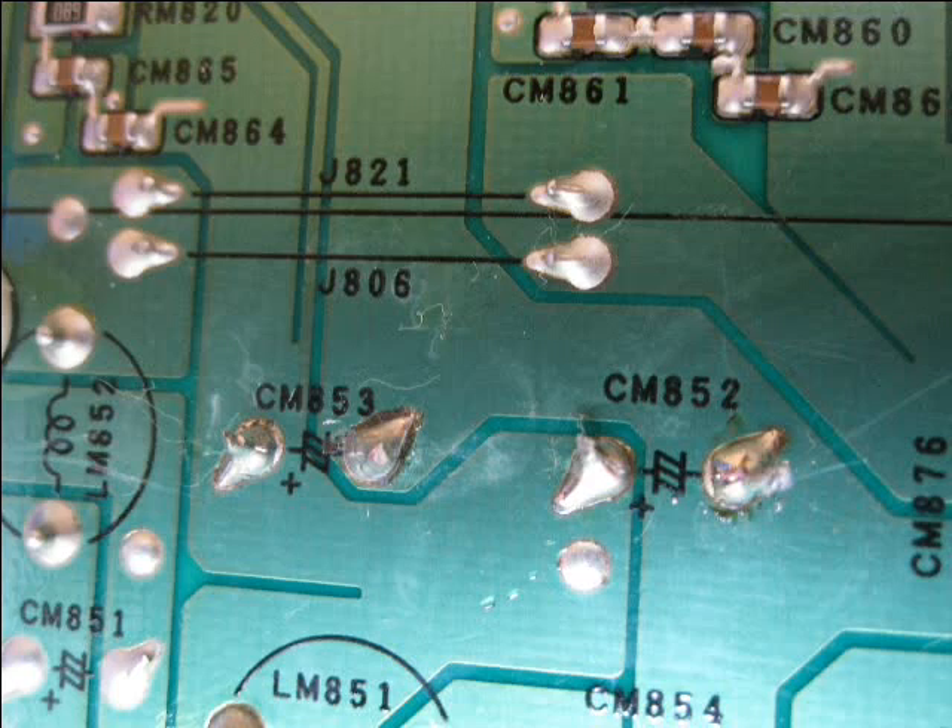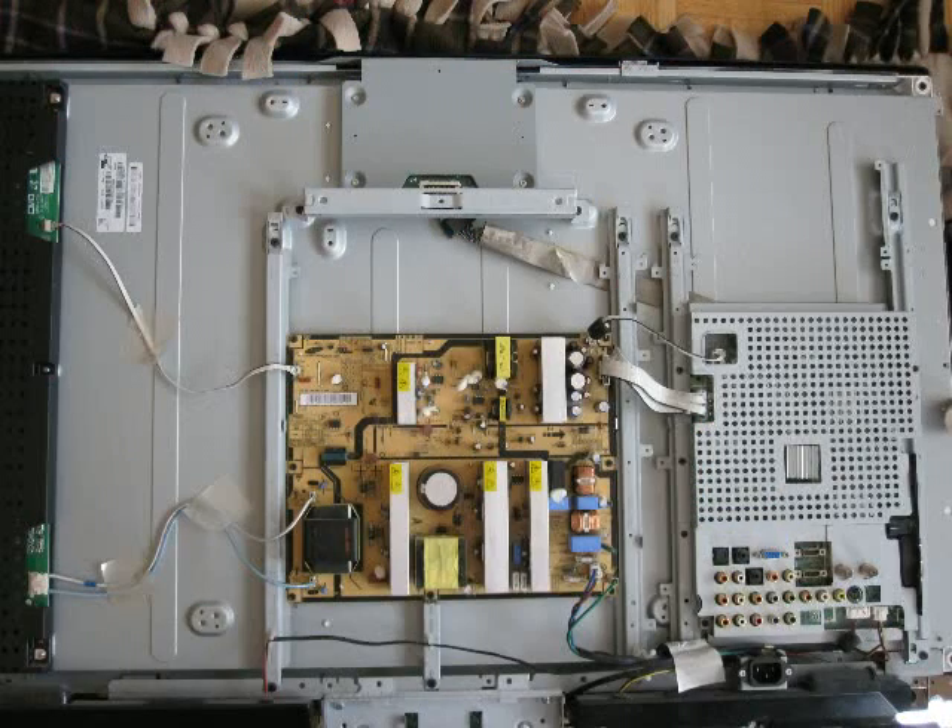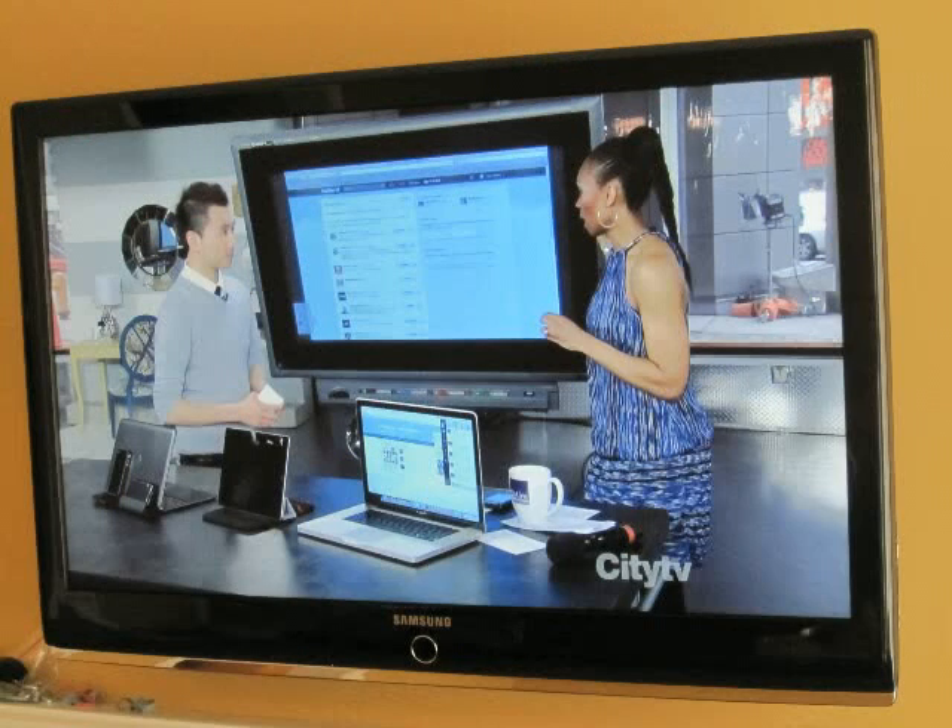Here I am assembling it all back together. All done and the TV is working — it will power up in 5 seconds. The cost of the two capacitors was $1.50 each, for a total cost of $3.00. Samsung does not want to fix these because it would cost them way more. However, the whole experience and poor support from Samsung means I will never buy Samsung again.